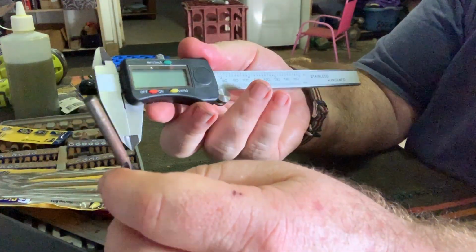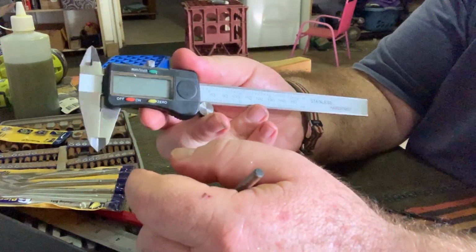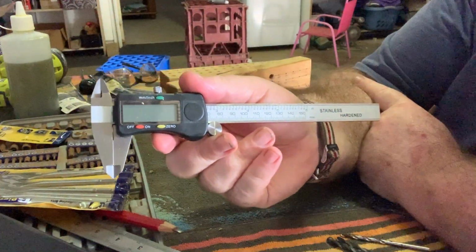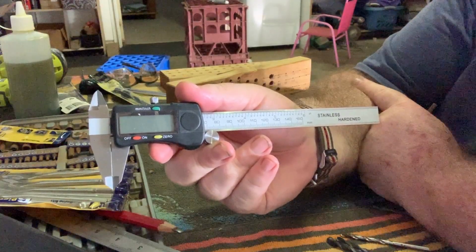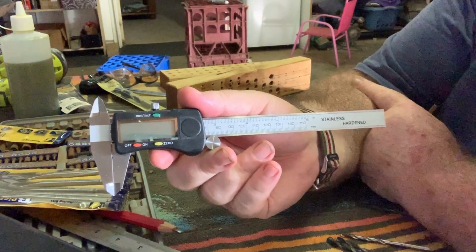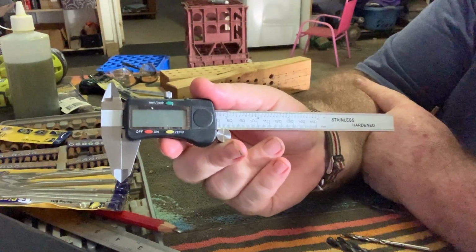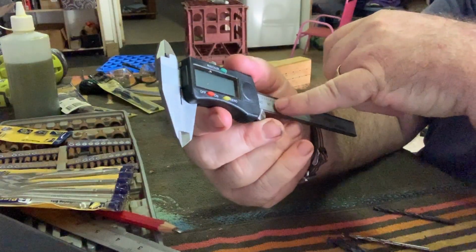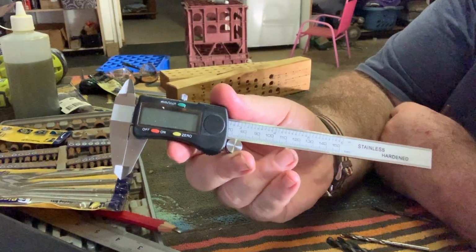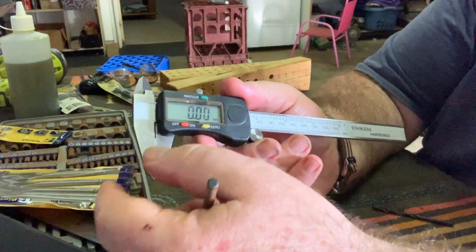So what we were using at the workshop last week was a simple micrometer. Like I said, I managed to pick up a digital Vernier Caliper. Now these can be used for measurements up to, I'm going to guess, 1/100th of a mil. The micrometer will go to 1/1000th of a mil. I really mostly need 1/10th, so this thing is more than accurate enough. You can learn how to read the Vernier Caliper, and I've got another one over there which I do use sometimes, but now that I've got this little fella with its digital readout, I'm probably not going to bother ever touching that one again.